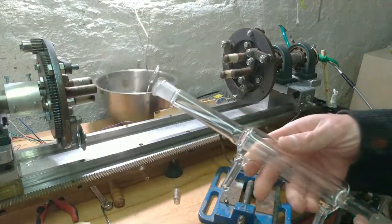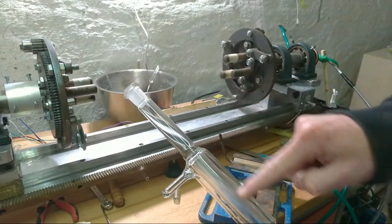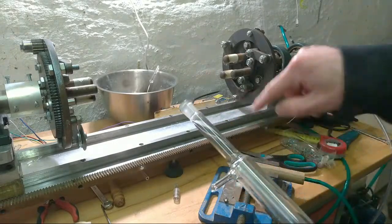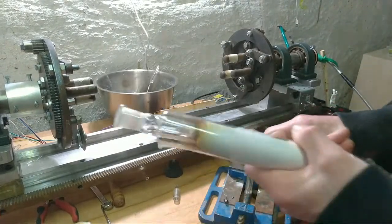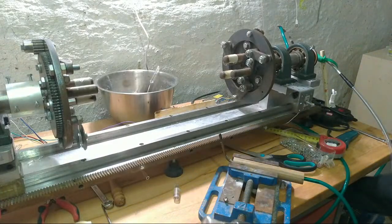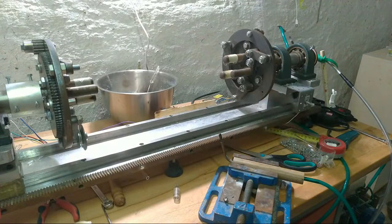When I made this thing, I pretty much made one side. I made this piece, I connected these pieces, three, like four. This side of the tube was floating in air, and then I had to anneal it, because before I always made one side, let it cool down, and it cracked and it was lost, basically. So I made this side, annealed that, took it out, made the second side, again annealed it, and that worked. Now I have basically this thing. It's pretty much done in one go, so that was my goal, to check if I can make that work.